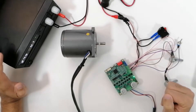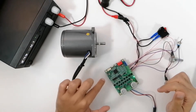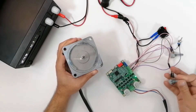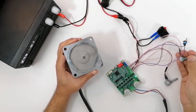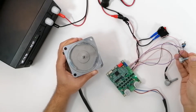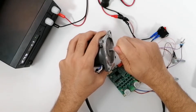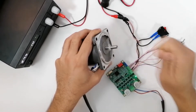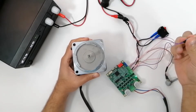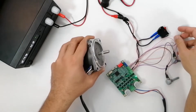I've set the power supply at 24 volts, which is the voltage of this motor. When I turn on SOLO the LED is blinking. I increase a little bit the magnetizing current and then increase the speed, and the motor starts to rotate. I keep increasing it — it speeds up and I can slow it down. Even at low speed it's resistive to the force I'm applying, so it's working in closed loop mode. I can also change the direction of rotation very fast and without any problem.